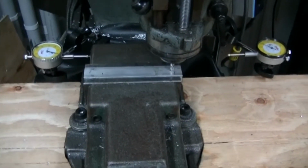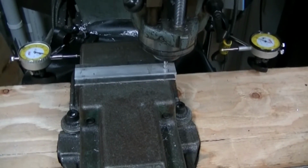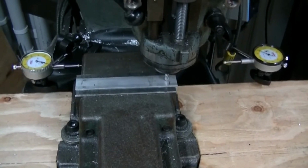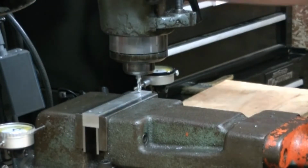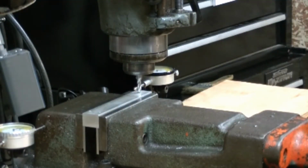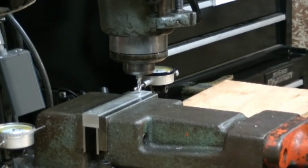So now we're going to start milling a 0.250 or 1/4 inch slot almost all the way through the piece, and we'll continue as soon as I get going. I'm going to lock my table in. I'll mill 1 hole all the way through. I'll raise the mill all the way up, travel to the other side to my opposite 0. I'll mill all the way through the part as well, and then I'll be able to traverse the workpiece entering into those pre-drilled areas as some sort of relief.